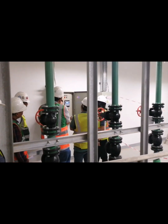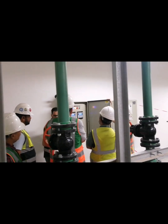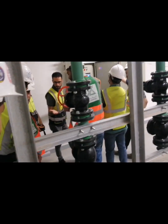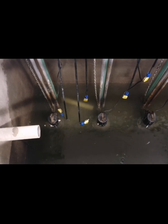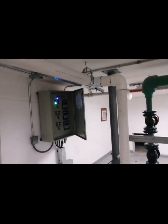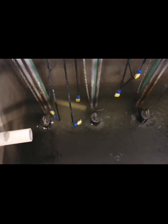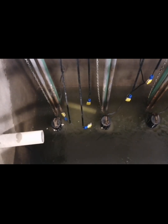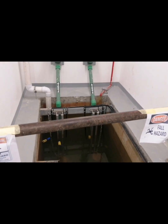Now there is a low level alarm. We make the switch down, then up — the alarm is showing that there is a low level. If this low level condition happens, in any case you will lift off the pump — no pump will be working. This is the scenario of the pump and the proper way of testing and commissioning.